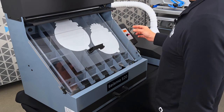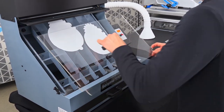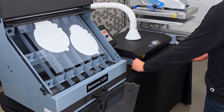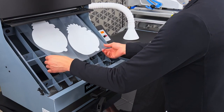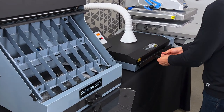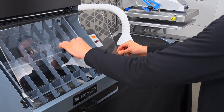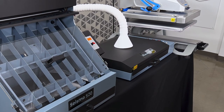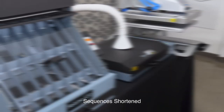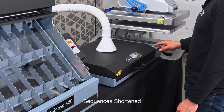After a few moments of vibrating the film, we can now shut it off and remove the film to place it inside the oven. We'll open our oven, slide our film sheet inside, and then we'll begin our timer. We're cooking our film powder at 275 degrees for about two minutes. When the timer is done, you'll hear a beep indicating that the film is ready to be removed.